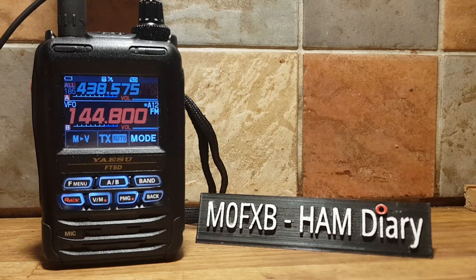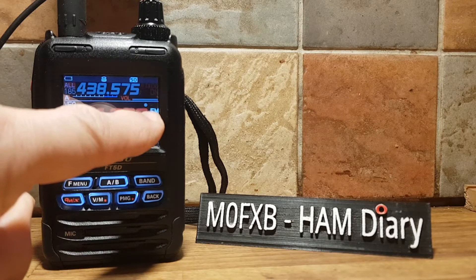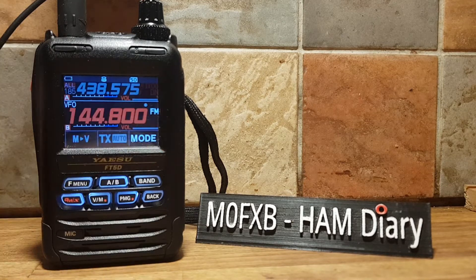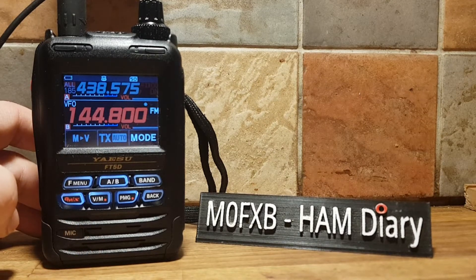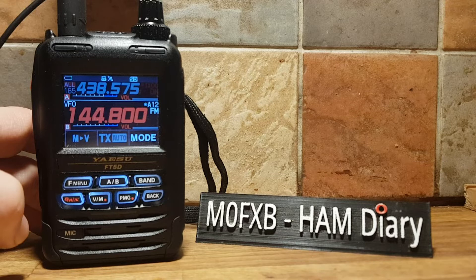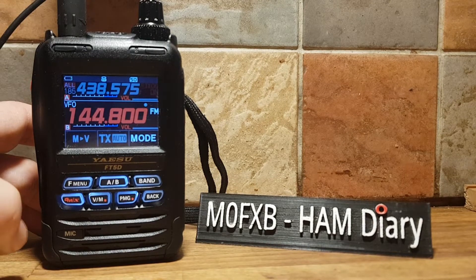So what are we looking for — what's the problem? Look here: the GPS and the modem are flashing, and that's because there is not a GPS lock. What you can do is select Manual GPS rather than trying to find the satellites or get a GPS lock.